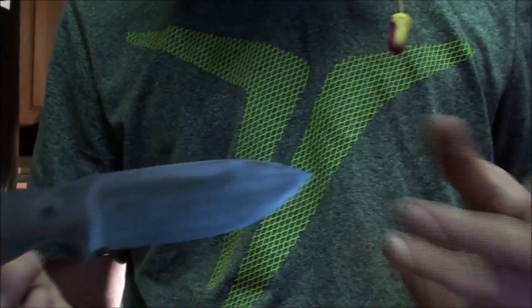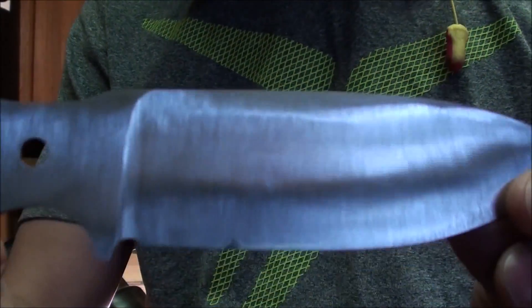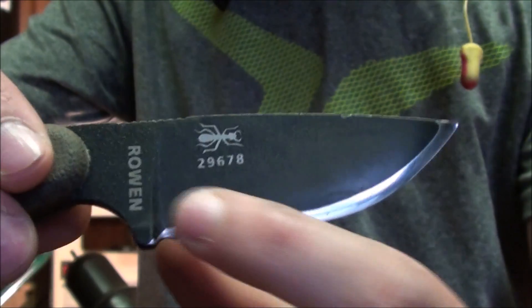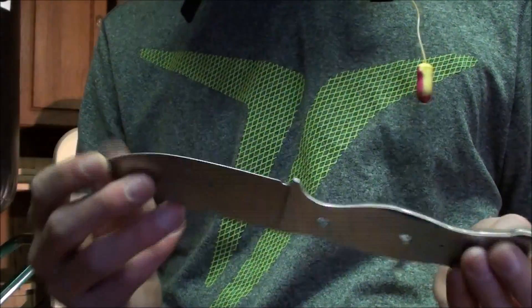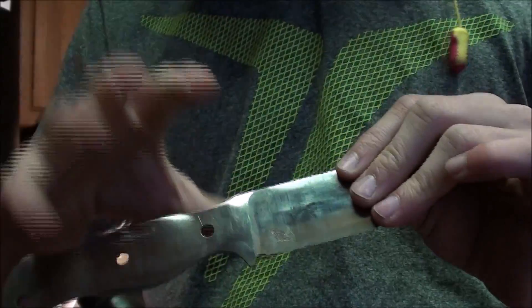This hasn't been an uninteresting video, and I know my voice sounds kind of funny, but it's because I'm wearing a respirator. What I've done is I completely flat ground the blade — this is called a flat grind. It goes all the way up, but it doesn't put a dent right here; you stop right at the end and it's a constant gradual thinning up the blade. It's a pretty good all-around type of grind for a knife. Then you just put a secondary bevel on — which on this you can see I haven't done yet. It's extremely thin, but I am going to put a secondary bevel to keep it strong. This is a camp knife for a Boy Scout, and so I'm going to make a kydex sheath for it, put some walnut handles on, and that's the end — but you guys won't see that in this video. This video today was just heat treating.